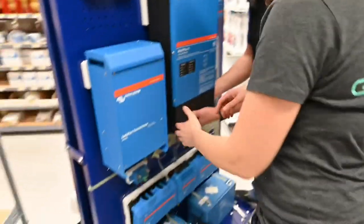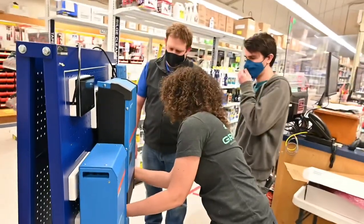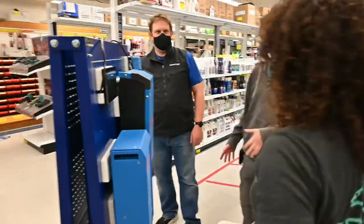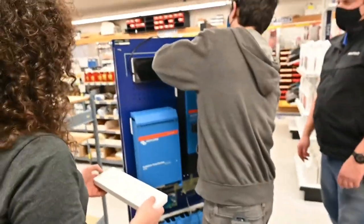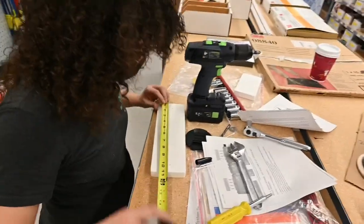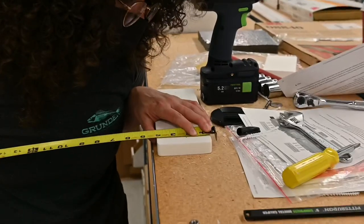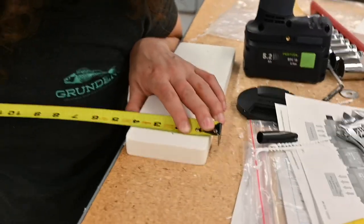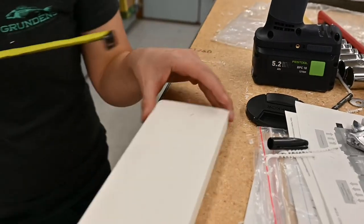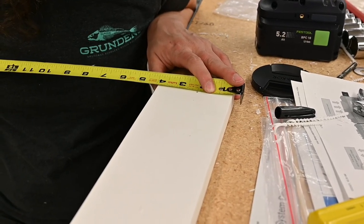So the bottom goes right to the groove. We can get it on the feet — it just needs two screws. We've got to make sure it's the same distance from the bottom as well — that's how it won't be crooked. So that is one and seven-eighths of an inch, just a hair over a tick mark. This one is also one tick mark over one and seven-eighths. Perfect — it's kind of a match.